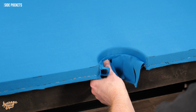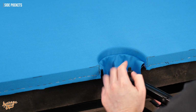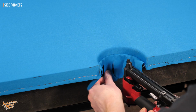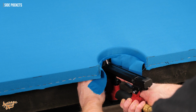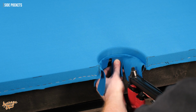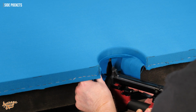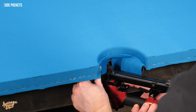So I'm going to stretch these tabs under one by one and get a staple into each. I'm stapling on the underside of the frame, and again I'm not using 1/2 inch anymore. You should be using a 1/4 inch or 3/8 if you've got MDF like we have. So you're going to pull your tab down nice and straight. Stapler to help pin it in. One staple. Second one here. Just repeat this all the way around. On your wider ones, you may want to put 2 staples.